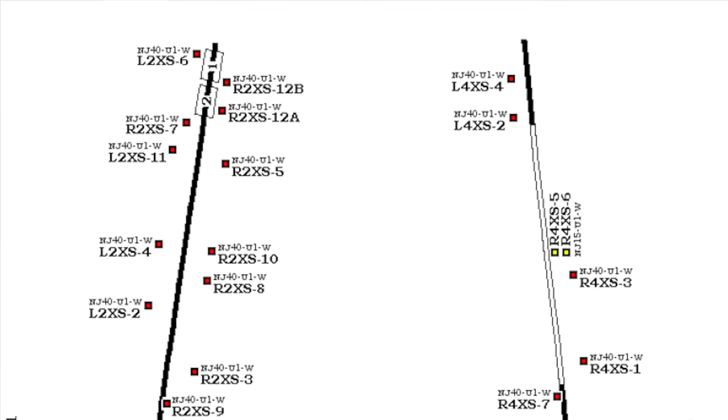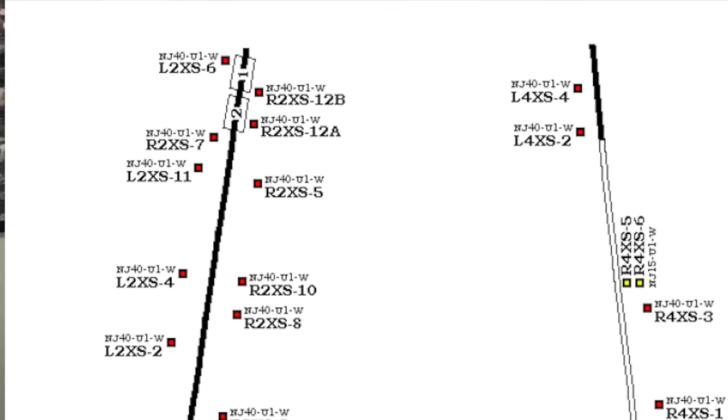So they're opposite ends of each other. You pass the proxes at pretty much the same time, both proxes, and it tells the station brakes to release. Because now Vekoma said, okay, the train is high enough to make it all the way around. So the brakes open up, and then the winch drum starts to slow because it knows it's reaching that unlock cam at the very top.